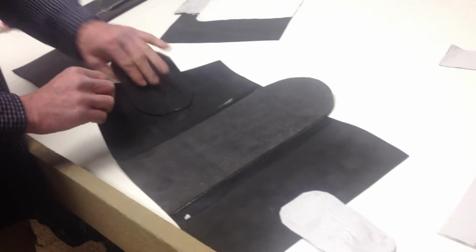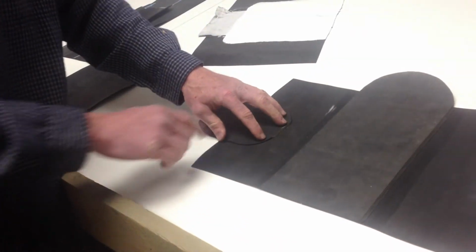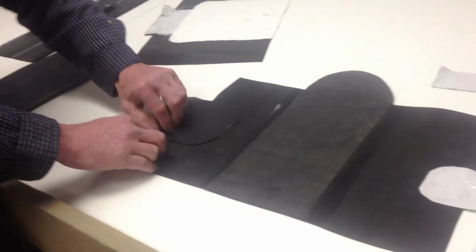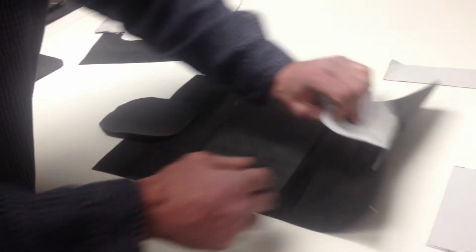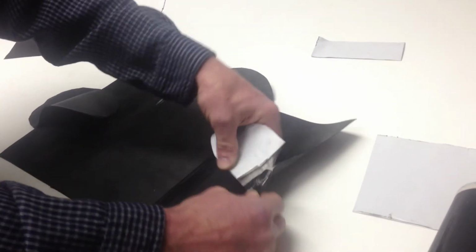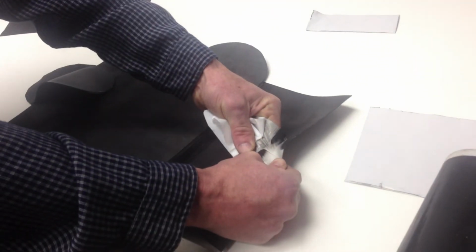This here is a standard Carlisle or Firestone tape. I simply popped it on with this last night, on a non-primed section. You can see the line of primer here and here. So it's just simply pulling off that black dead EPDM. It's not soft enough to absorb and get in there. You can see where it's black is where I just couldn't resist playing with it last night. But this is what you guys want.